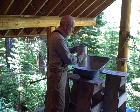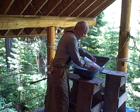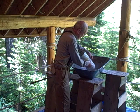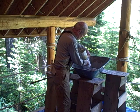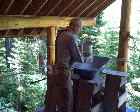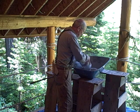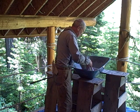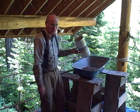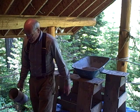So the first thing I do is dump that into my pan. I make a ridge of mortar right about in the middle of the pan — I'm making a dam. That has to be intact across so the water doesn't get behind it. That's not critical but it works the best for me.